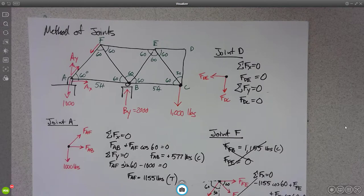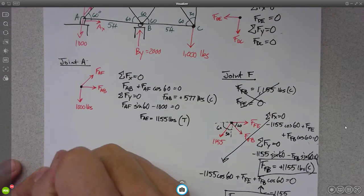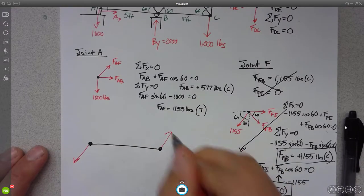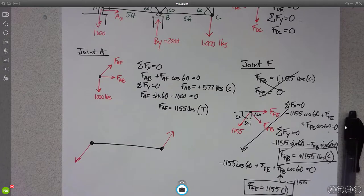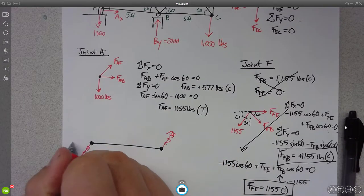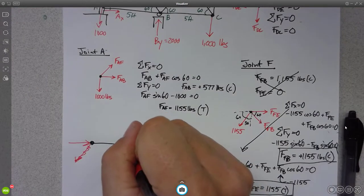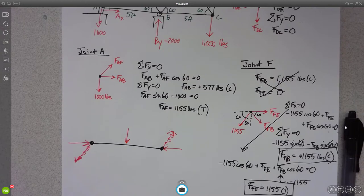So we have already defined two force members, right? A two force member is any member where the loads are applied just at two points, right? And in order for this member to be in static equilibrium, can it be this? No, it can't be, right? In order for this guy to be in static equilibrium, we have two options. It can either be in compression or in tension. And we're saying that all of the trusses we're dealing with are made up of two force members, right? Because all of the loads are applied at the joint, okay? And so there are no three force members allowed, right? A three force member is when I'd say, oh, there we go, a third force application location. That makes it a three force member. Now we can't really do truss analysis. There's other things going on here, okay?